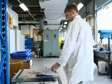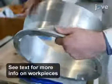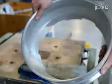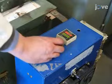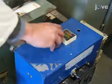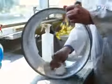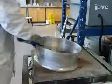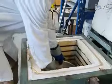To begin this procedure, acquire as-cast workpieces machined to the mandrel size, such that the inner diameter runout is 0.2 millimeters, while the outer diameter retains as much cast surface as possible. Preheat a coffin furnace able to receive the entire workpiece to 135 degrees Celsius. Clean the workpiece with degreaser and place it in the furnace for an hour to prepare for thermal barrier coating application.